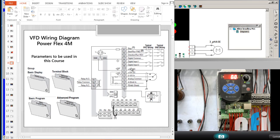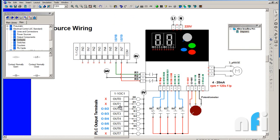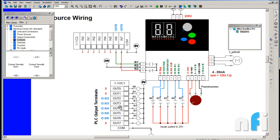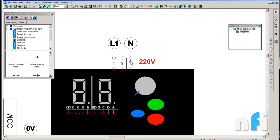This is the diagram which you generally find in the PLC or VFD manual. I have created an interactive version — this is the actual diagram on my trainer. I'll be linking my PLC to the drive, so to understand the further lessons we need to understand this diagram. Starting from the top, these are the input terminals to which we have connected line and neutral. You can also connect MCBs, contactors, or relays here. The input is 220 volts single phase, or three phase 220 volts as well.